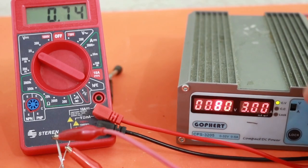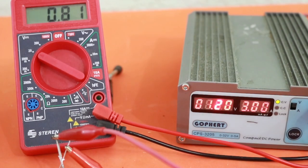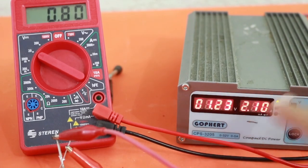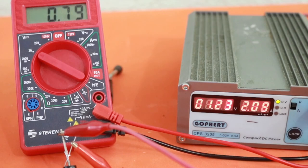Let's put now 1 volt — only 0.8 volts in the capacitor, but we are drawing more than 1 amp in the diode. At 1.2 volts, the capacitor still has 0.8 volts and the excess voltage is consumed by the diode, which is now drawing 2.1 amps. So in this way, the diode is helping the capacitor to stay close to 0.7 volts.